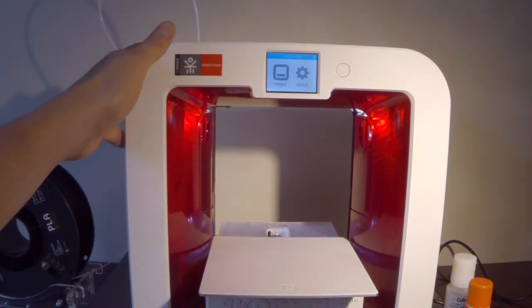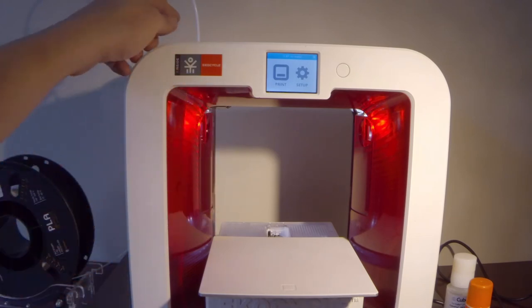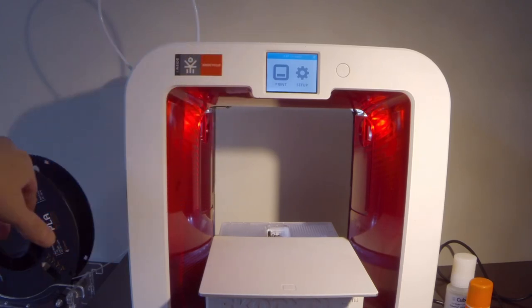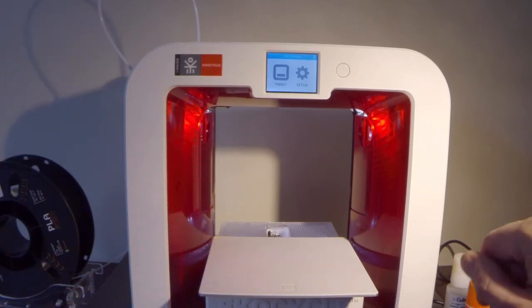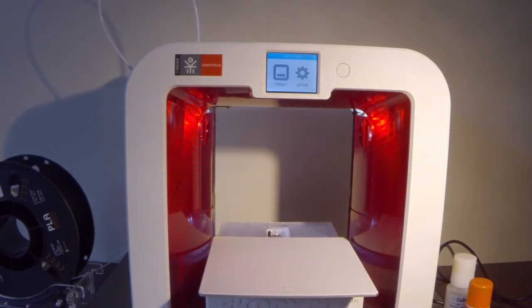If you have multiple cartridges, if you're one of those people that actually has quite a few cartridges and you swap, every print tip is a little bit different. And you are going to want to do that for each cartridge because the print tips are different. And in that scenario, I would recommend actually writing the recommended Z-gap for that cartridge on it with a Sharpie. And then as soon as you pop it in, you know where you're supposed to be.